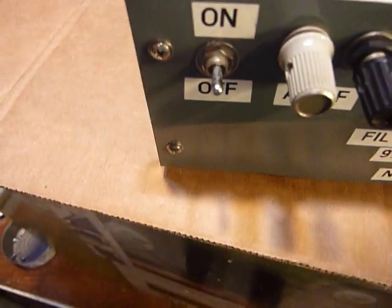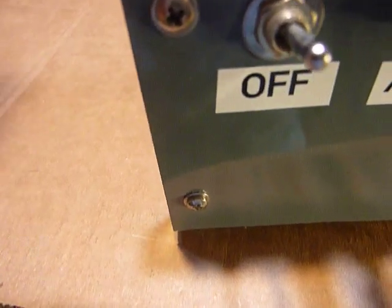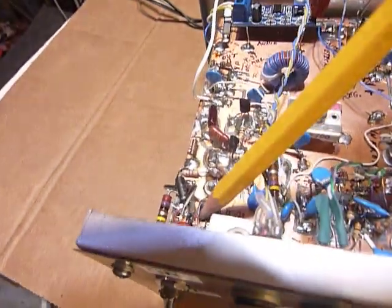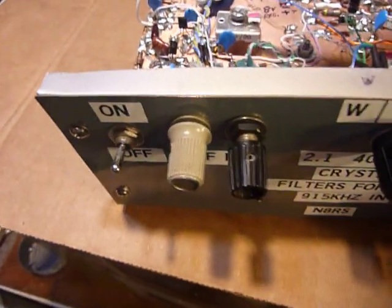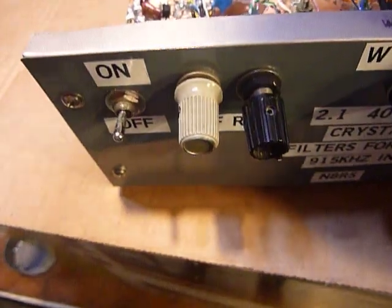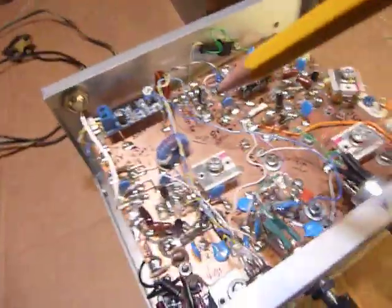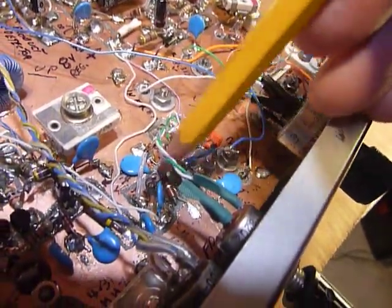And so that has that oscillator, 4.310 megahertz crystal there. And like I say, I ground that myself, and then that feeds the SBL1 there. It comes out at 3.395. The output signal then goes through an MC1350 IC, which is upside down right in here.